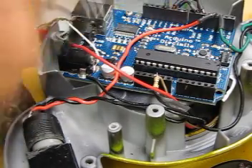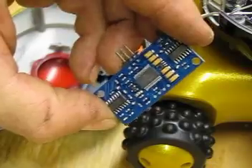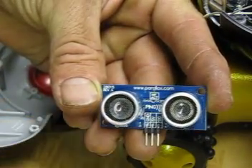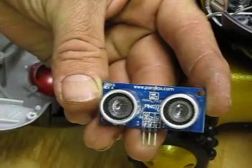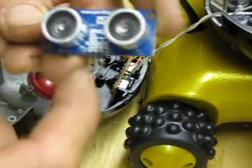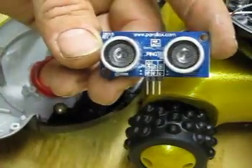The next thing that has to happen is we have to have ears — they look like eyes, but they're ears. This is a ping sensor from Parallax, a little device that has its own circuitry on the back that takes care of all the digital stuff. It puts out an ultrasonic signal that we can't hear — I don't think dogs can either, and they don't seem to mind it. Then it gets a ping back, so it's like a bat: sends out a signal, bounces off something, comes back, times how long it takes, and outputs a signal. There's a 5-volt signal, a ground, and a signal output — we just feed it 5 volts and a ground, and trigger it. It's pretty easy to write the code for this; I'll show you that later.